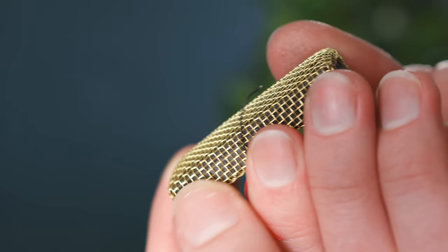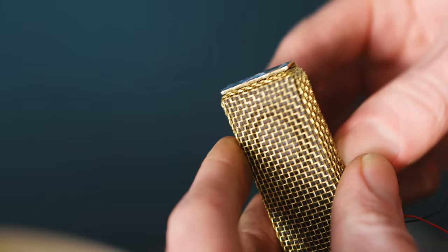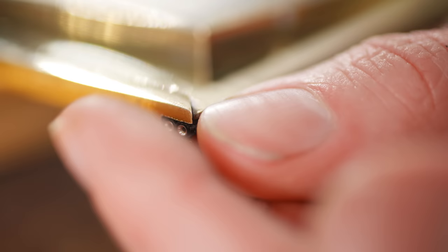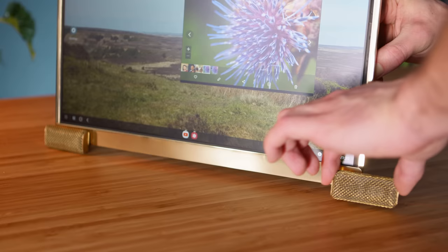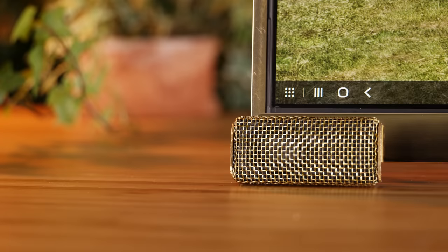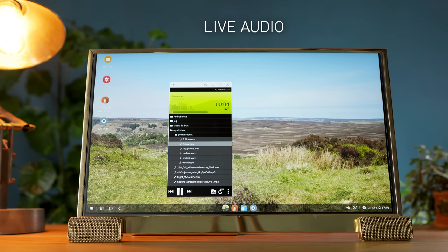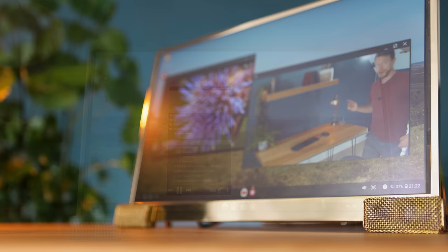A good way of making a back for these is to bend a strip of brass that can be glued in place with epoxy. Pin connectors are added to this back, with sockets mounted on either side of the bottom of the screen. Wires are provisionally added to the control board's speaker output so these sockets can be easily hooked up to the board's internal amplifier, allowing the drivers to just be clipped in place when required. Not only do these look really nice aesthetically, but they sound amazing given their size — and directly facing the listener really helps their clarity with a nice stereo effect.